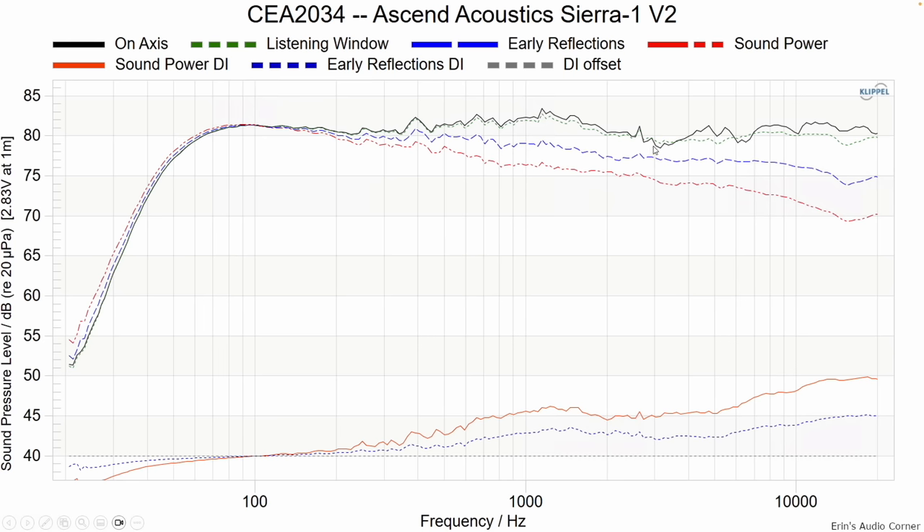Not a big dip in diffraction elements, but there is a little bit of diffraction going on. Early reflections directivity index looks really good, but even in the crossover region there's a mild flattening right through there — maybe some directivity mismatch. That's going to be due to the vertical positioning of the tweeter and the mid-woofer. The further those two are separated, the more there's going to be a mismatch in directivity, unless the crossover slopes are extremely steep. In this particular case, the fourth-order acoustic crossover slopes make this speaker have better vertical directivity than other bookshelf speakers, even when their tweeter and mid-woofer are placed closer together.